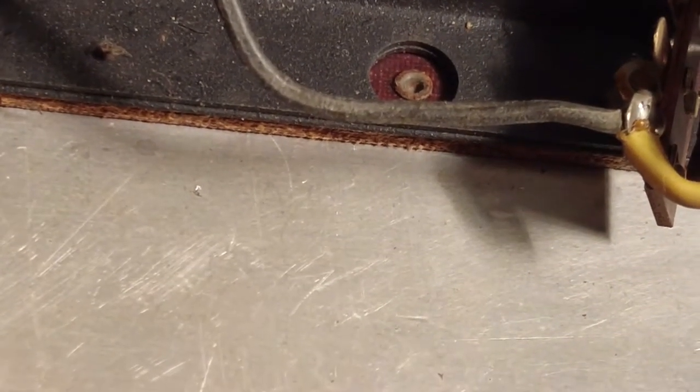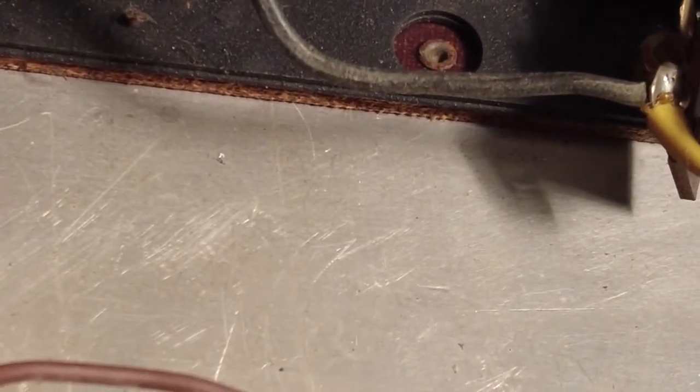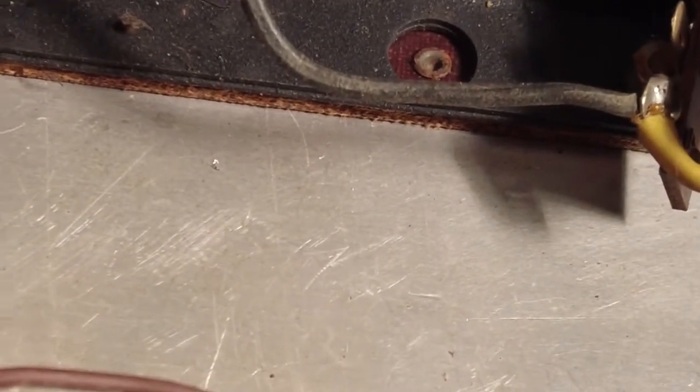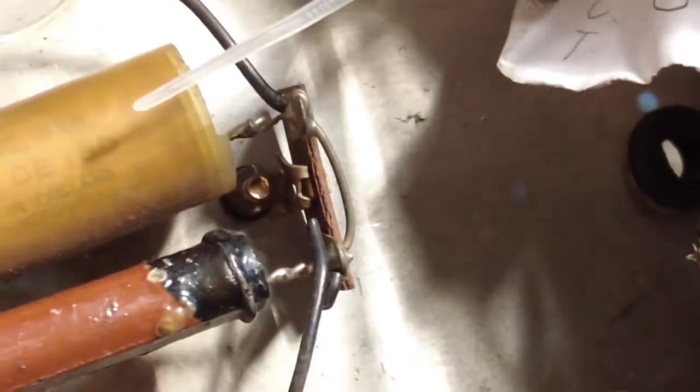That's an insulation wafer. So the way they got around making this chassis safe basically was they put neutral on the top where all the wiring is, on the top of the chassis, and then they use those capacitors to isolate it, and then grounded from those capacitors to the sides. So the sides had an earth, the top actually didn't have an earth to the wall socket.